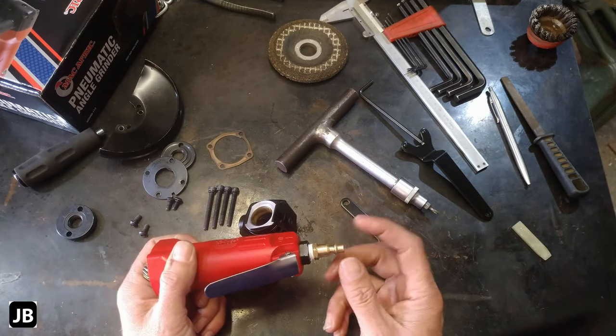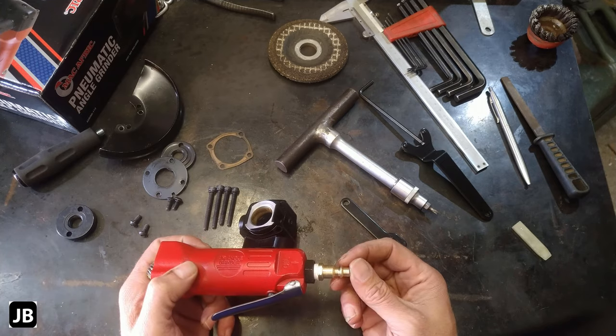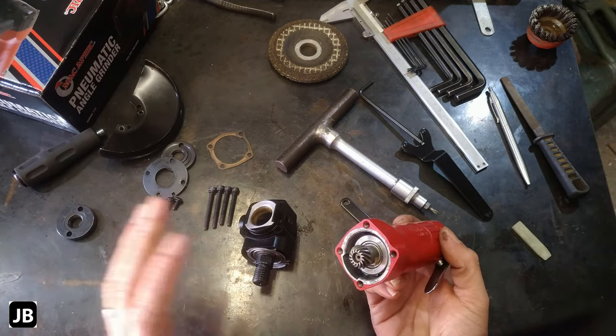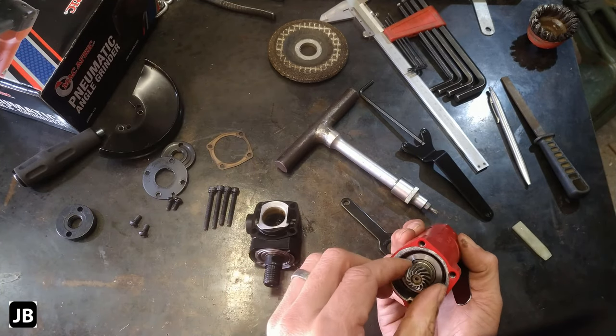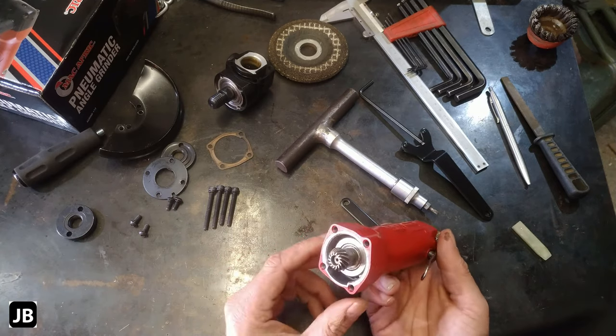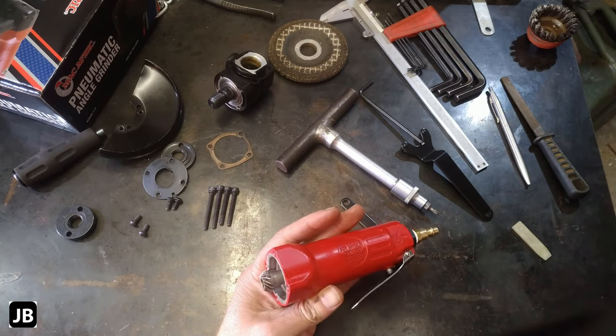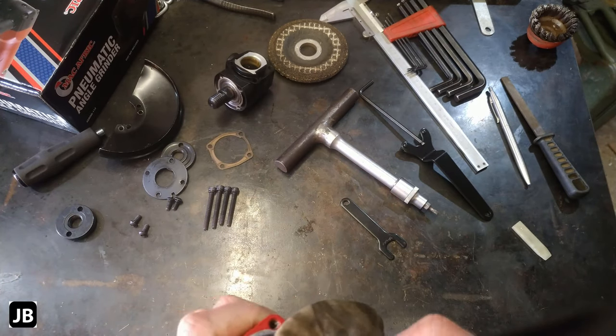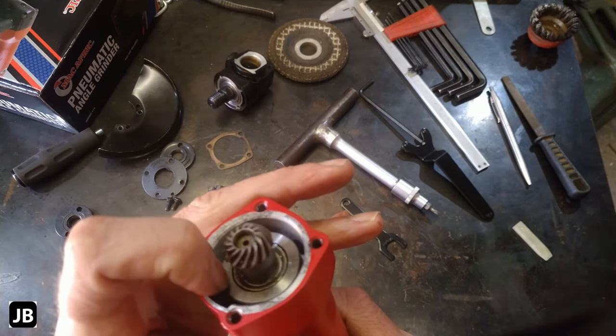Getting to that, on pneumatic tools, on the first time using them, chuck in a lot of oil in there the first time around. It just lubricates everything up nicely and make sure that everything's there. And I think it'll definitely lengthen your tool life. Now let's get to the actual rotor side of it. As you can see, that's where it blows the oil through.